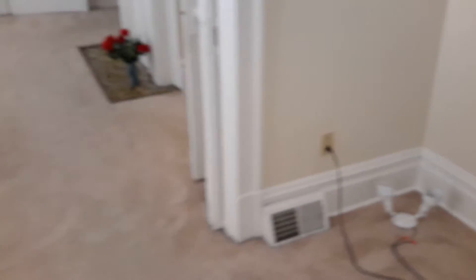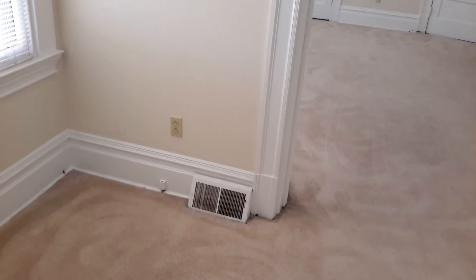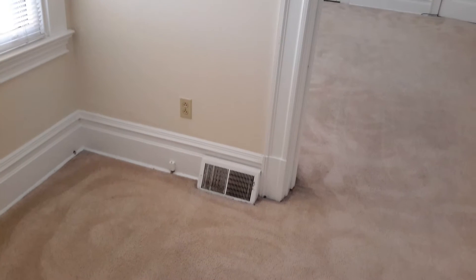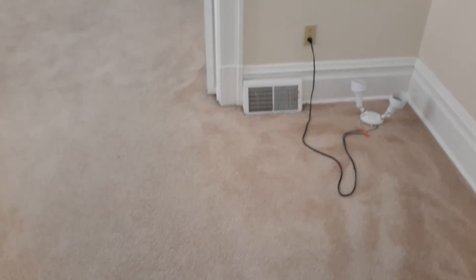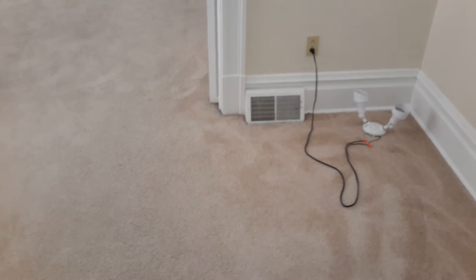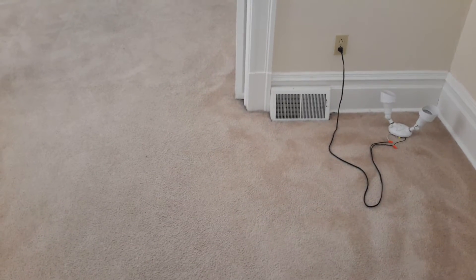We have plenty of plugs in the walls. Usually where there's a plug on one floor, I ran a plug to the second floor — that's usually a good way to do it. All wires go to the basement. I don't go into one plug and jump from that plug to another anywhere. Each wire goes from the plug directly to the basement.